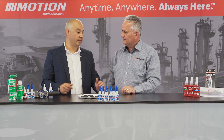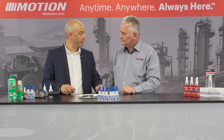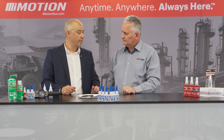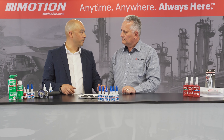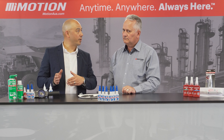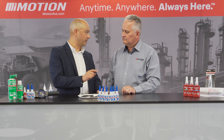I love these products because they're so quick. CAs, or cyanoacrylates, are really good at bonding a variety of different substrates and they do it quickly. I wanted to demonstrate the difference between 401 and 406. If you've got 401 or 406 at home it will bond the majority of substrates. We've got the luxury of having both. I tend to look at 401 as bonding metals a little bit better, and 406 is more geared towards plastics and rubbers.